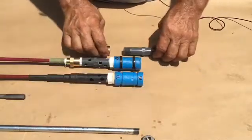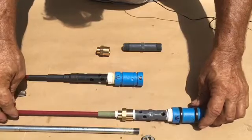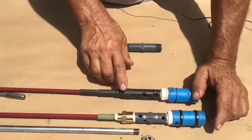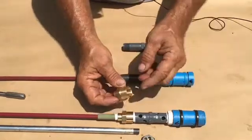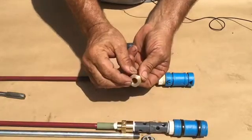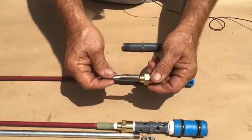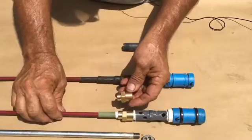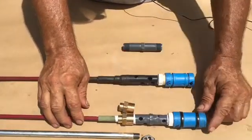What I've done since the other video is the plunger assembly will look like this now. We got rid of the filler piece, the glue, the fitting, and sticking all that in here. This right here is a brass fitting. It is half inch female pipe thread, quarter inch female pipe thread, and a half inch 20 die — you can re-thread the holes to re-cut all the threads, and the rod will stick right into it. Makes a lot neater looking job, a lot stronger.